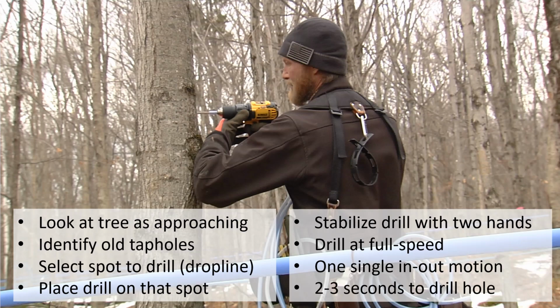Do you use a drill stop of any sort? We usually use a piece of tubing. Yes, that's the preferred method at Proctor. Okay. So we'll measure the drill bit, cut the tubing to the selected size, jam it onto the drill bit, and I check it periodically.